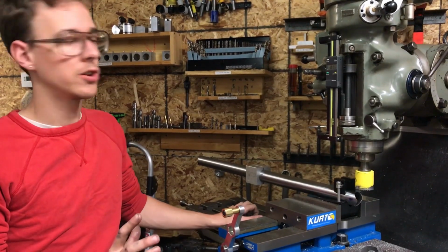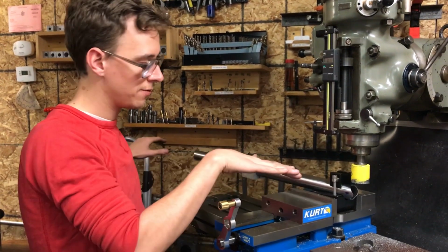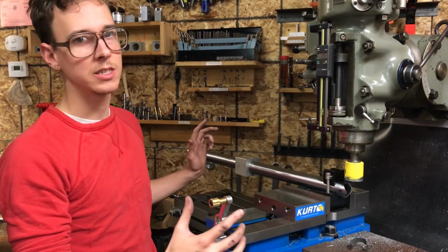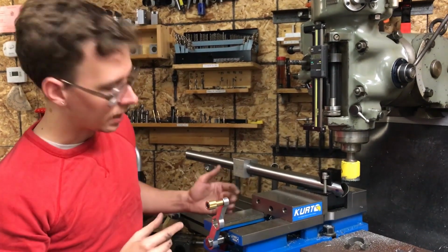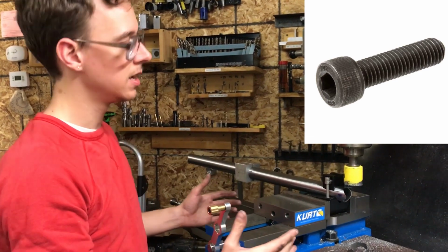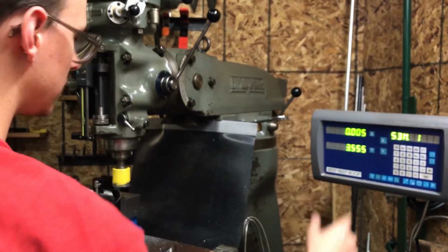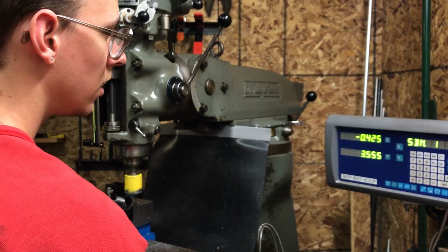So I'm just gonna take another cut. I put it back in the machine. I set it to 90 again, level with the machine, perpendicular to the spindle. And because of that pin, it sits back in the machine just about exactly the same spot. That pin has a pretty good fit. It's a 3/8 diameter pin in a cap screw that's made for a 3/8 hex tool. So it fits in there nice, and it's pretty repeatable on location. And so here I had this zeroed out, that's basically zero. So I'm just gonna move the table over 1 whole millimeter. We'll see.